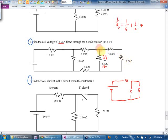Okay. Can I start here and end up here going through this or both of these? These together have to lose 12 volts. These together have to lose 12 volts. And these together are a single 12-ohm resistor. What's the current flowing through this resistor then? Louder, you're right. 1 amp, which means if I got 3 amps and I got 1 amp, how many amps are going through this 2-ohm resistor? 18? What's 18? Oh, the 8, I'm sorry. Not 12 volts. Good gosh, Mr. Dueck. Thank you.